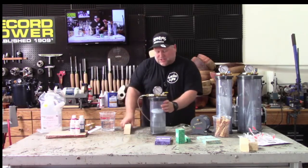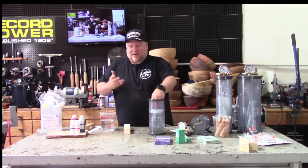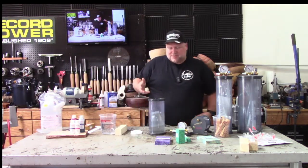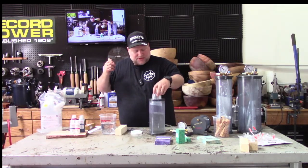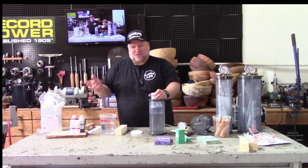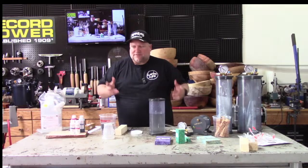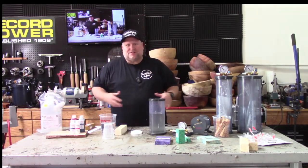Now, the question generally comes up, how long do I vacuum for? There is no answer because everything's different. Even the same species of wood would be different time frames. Some woods, we have a real big vacuum chamber next door that we do our stabilizing in. Some days we run it a couple hours. Some days we run it 10, 12 hours and it's still not done. So it depends on the wood, how big it is, how punky or whatever it is. But you run it as long as you need to get all the air out.